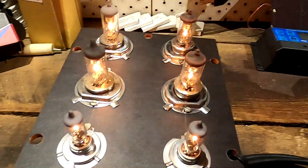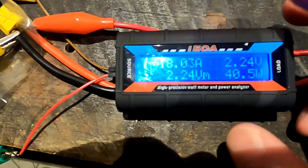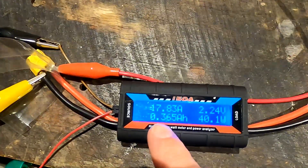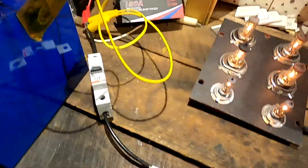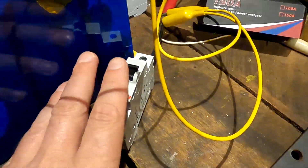And there we go — magic! We can see 18 amps being pulled at the moment at 2.2 volts only. The voltage drop is because of the thin cable. Once I cable everything properly with 4mm cable, we shouldn't have this voltage drop anymore. But we are pulling 17 amps and we've got a 10-amp circuit breaker, so this will turn off in just a few seconds. And there it goes — it works because it has a bimetal thermal trigger for the circuit breaker. We'll talk about this setup in a future video.